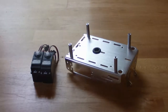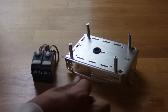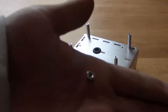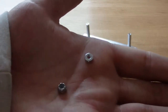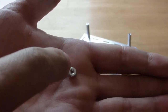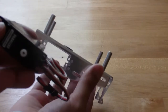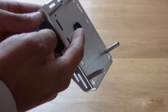Now we want to mount the servo motors to the chassis using 3/8 inch pan head screws and some regular nuts. There are two types of nuts in this kit: regular 4-40 nuts for general purpose use, and lock nuts which have a little bit of plastic material that prevents them from coming loose under vibration. For mounting the servos we actually don't need the lock nuts — just the regular 4-40 nuts. We want to put the servo on the inside of the chassis with the shaft aligned with the through hole where we put our grommet.